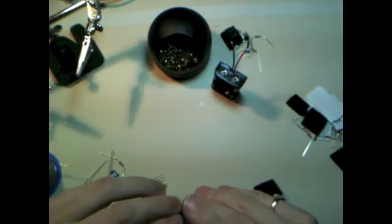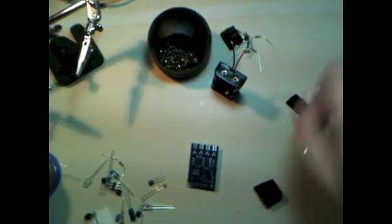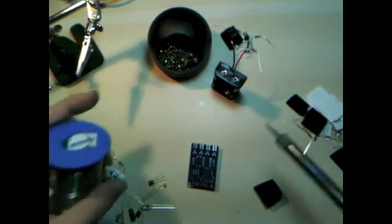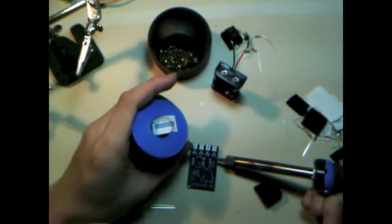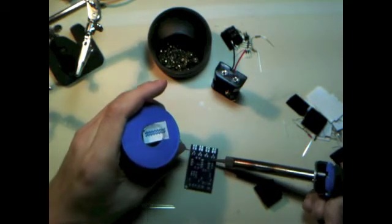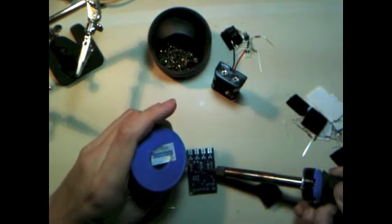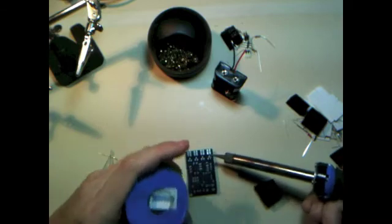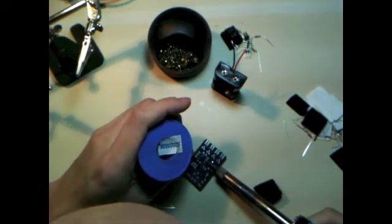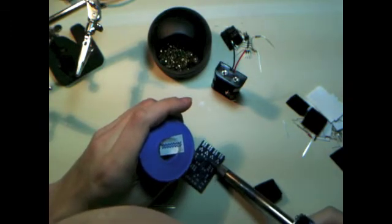Next, we've got this chip mount in the middle. I like to put this flat on a table and then solder it in. It's a little bit easier than trying to hold it in a pair of helping hands. You'll notice the way I'm holding the end of the solder with my thumb — it's really easy to twist my left hand and push out with my thumb so I don't have to let go and I can keep getting more solder.